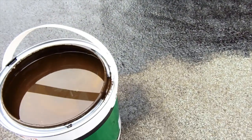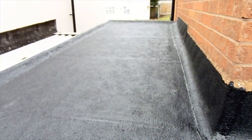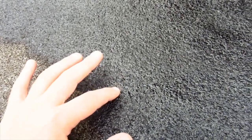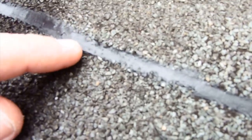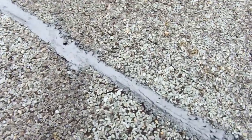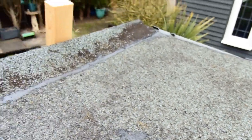Before my can runs out - this is a new can - you can see I started off down there and got to here. So you can see this is the faded old felt, and the idea is to just give it a coat of this rubberised bitumen emulsion and it brings it back to life. It looks wet but it's not - it's just giving it a nice waterproof coating and soaking in. Any of the weaker parts and joins I've just filled with the gutter seal as I go along. A few cracks I've given a little skimming.